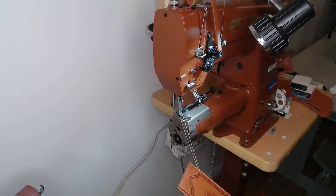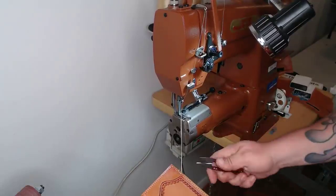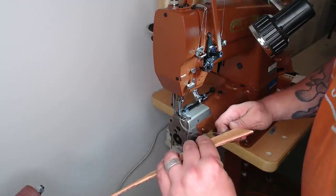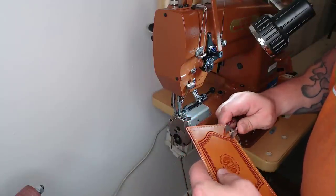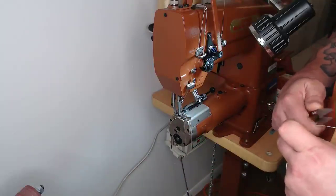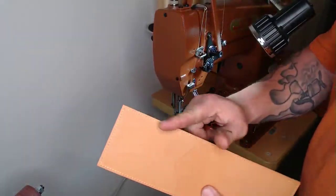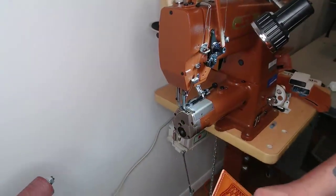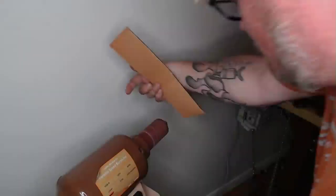So grab a pair of nippers here. And I'm going to go ahead and do the next part of this while I'm over here because my sander is right beside me. And that is, I'm going to sand the edges. And that'll get any glue and stuff like that off, and it'll take care of any areas where maybe the edges aren't perfectly lined up. And yeah, so I'm going to move the camera just slightly over here. Unfortunately, I have kind of a shortage of plugs in here, so I'm going to have to reach across and unplug that machine. Otherwise, I have to unplug the computer, and I don't want the battery to die while I make a long video.